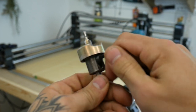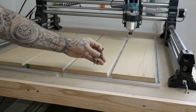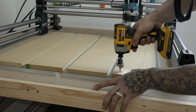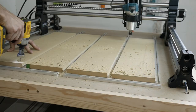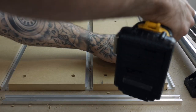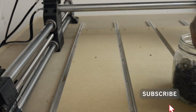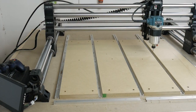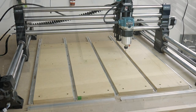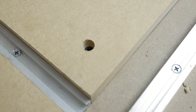It has this little bearing on here so you don't mar the surface. I'll be roughly shooting for the depth at least even with the T-Track, so you can surface this a few times before you need to replace all the pieces. I just kind of plowed these all in here, but if you plan on doing the grid I would measure a little bit because it's quite obvious how uneven they are with the straight grid lines. These are just inch-and-a-quarter black drywall screws. I used two screw holes in the front, one in the middle, and two in the back. The screws are relatively deep — at the height of the T-Track or a little deeper.